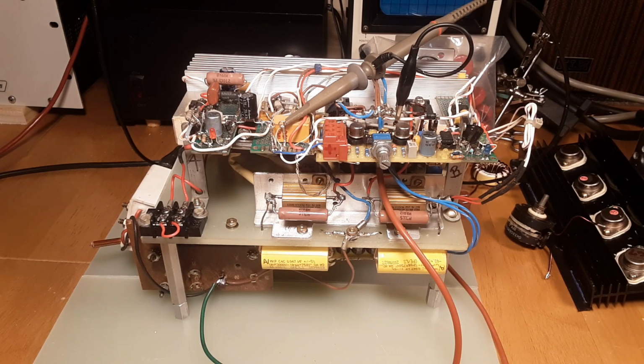So I thought, okay, well, I'll put it on the table and spruce some other things up on it. So I did some other stuff to it. I was just ready to do a video on this, and I put it on the bench and powered it up. I got an arc out of it the first time, and then the second time, no arc. And I thought, man, this is kind of messed up. I tried and it just wouldn't arc anymore. And then there was one time after that, which I think is kind of important to note, that it did. And then it's quit now, and I haven't been able to get it to arc for quite a while.